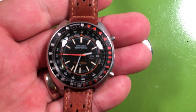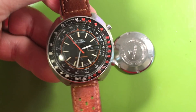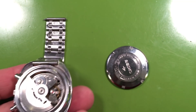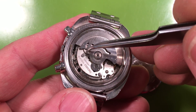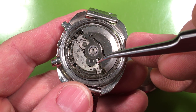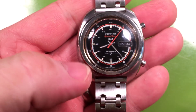Here's the one I just restored for myself last week — that's a neat watch, a little warm, but super cool. That one was a lot of fun to bring back. Yours is functional and good. The movement is clean. These are fairly tricky to service — they've got a few funky things about the diafix settings — but they're not nearly as gnarly as a 7018 or 7016. Beautifully made chronographs; Daini really knocked it out of the park with these.